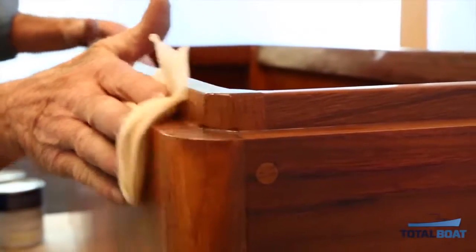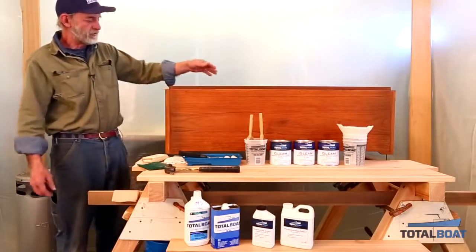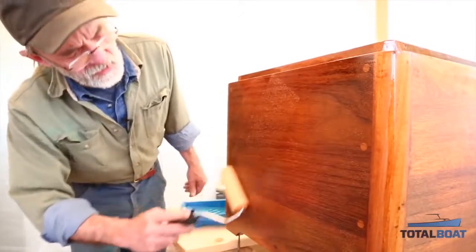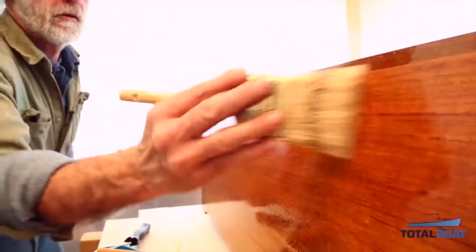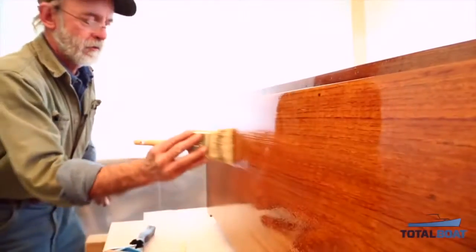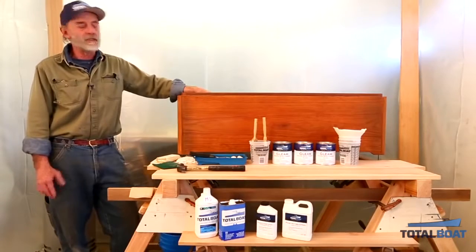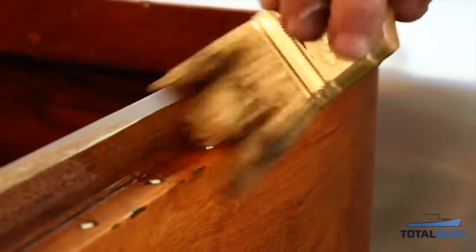I've got the piece in a dust-free environment here, and I've vacuumed the room and cleaned the walls. I'm going to roll and tip this varnish on myself, because the first 5 or 6 coats I put on here I actually did with a brush. So I had a little difficulty getting all the way around the box without having a run or any little problems like that. It really hasn't caused me any problems in the end.